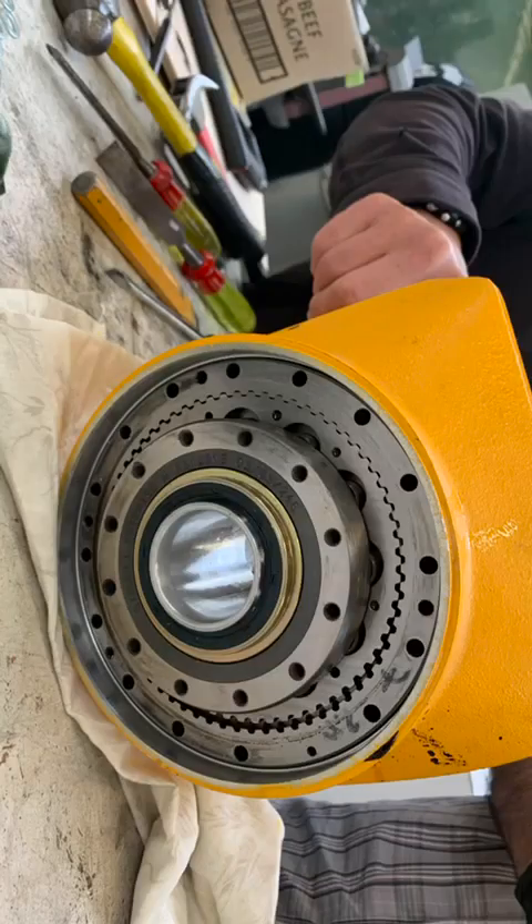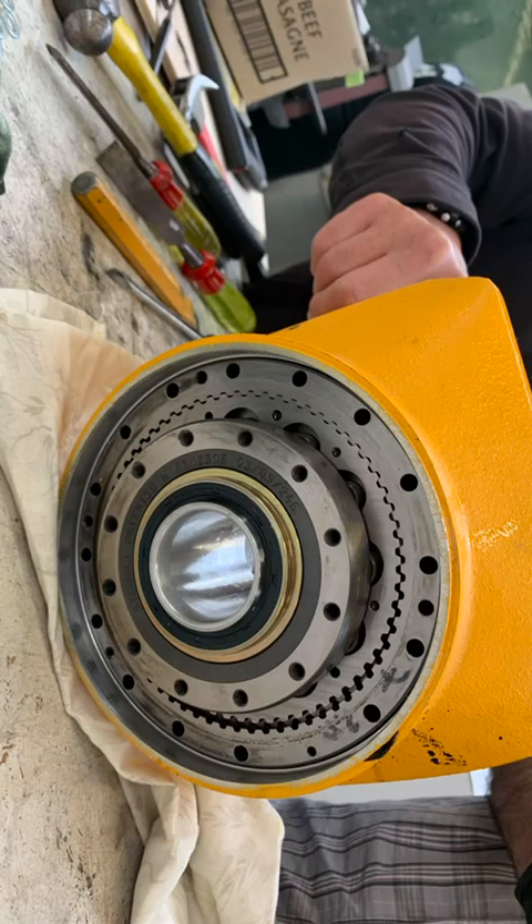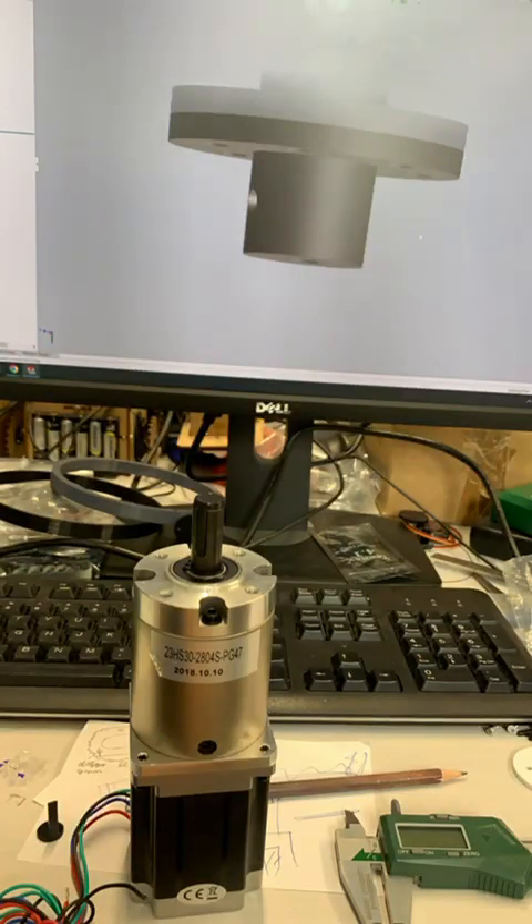In the early stages of the project we decided it would fasten the prototyping phase if we used a recycled robotic arm component which was sitting in the workshop collecting dust. I then researched a motor that will have sufficient torque to be able to rotate the first link and ended up selecting a NEMA 23 with a gear head.